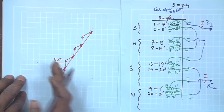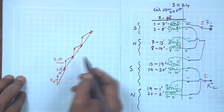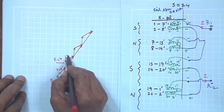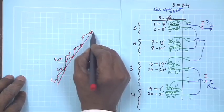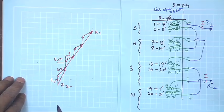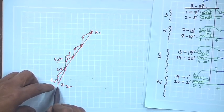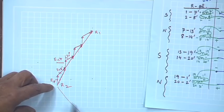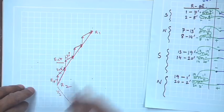These, because all lengths are equal and they are equally shifted, in this case by 30 degree. So this will be your R1, R2. Similarly, the Y phase, if you sketch the phasors, you will see that capital Y1, Y2 will be shifted by 120 degree, Y1, Y2, etcetera, that I am not doing, and you can easily show that.